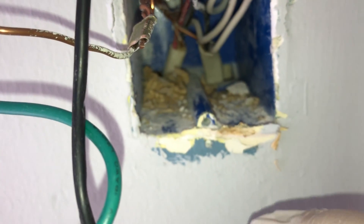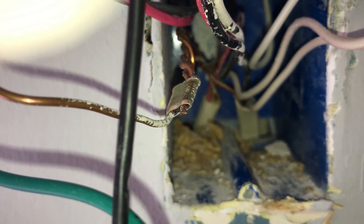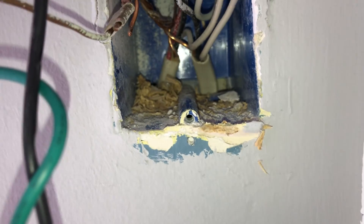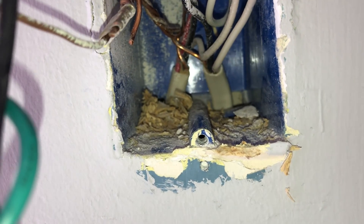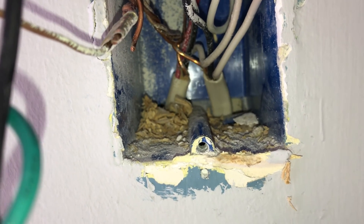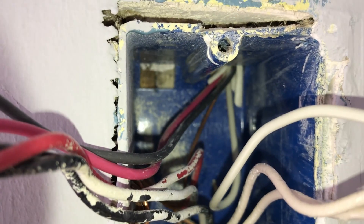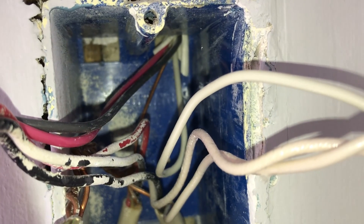Let's go over what all these wires are. You have wires supplying power entering this junction box from the lower left, and wires leaving through the lower right to feed power to some other part of the house, like an outlet. The wires leaving through the top right are powering the fan and the lights on the fan. All the neutral wires, which are the white wires, need to be connected together.